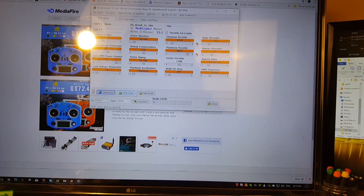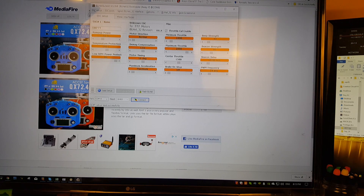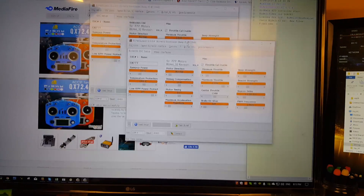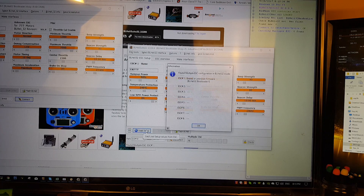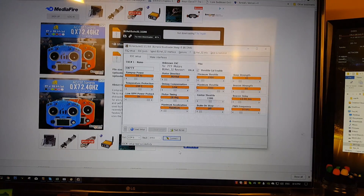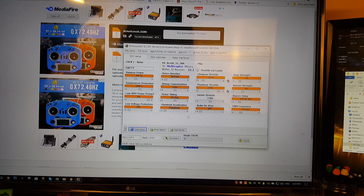As you can see right there — that is sweet. Let me quickly show you. I had the older version of BLHeli 32 open, which won't connect. With the old one it shows unknown firmware — you'd hit OK and try to flash, but it wouldn't flash. I was very worried because of the typo on the ESC. But with the new version, we say connect, read setup — boom, we got it. That is just sweet, I'm very happy.